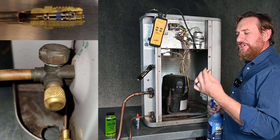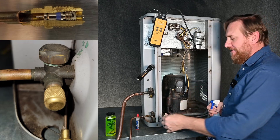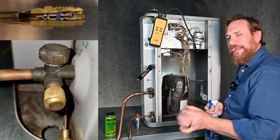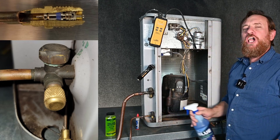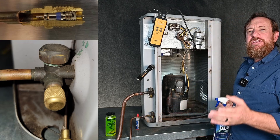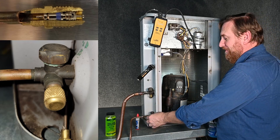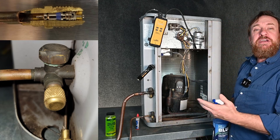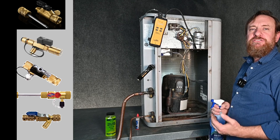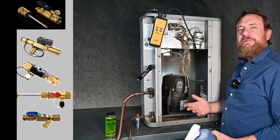We don't want any contamination. A trick is using a valve cap — just barely screwing that valve cap on, just catching one thread. Now you can put a leak detector all around that valve cap. If we see bubbles coming out around that valve cap, we know there's a really high chance we have a refrigerant leak on those Schrader cores. Then we can get our valve core removal tool and change out those Schrader valves, those valve cores. That's a simple thing to do to make sure we're not leaking.